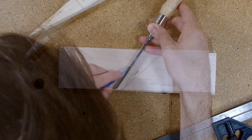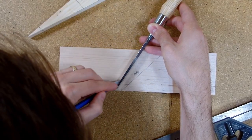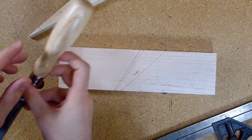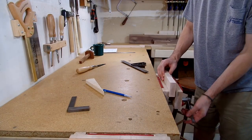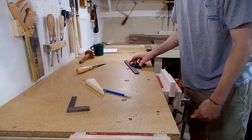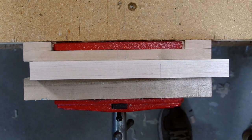For the final layout line, I took the chisel, lined it up with the wedge line, and traced the last line. This will help account for the thickness of the chisel. I then needed to lay out lines on the top and bottom of the plane. For the bed angle, I simply marked a line 90 degrees to the face, which would create a flat bed angle.